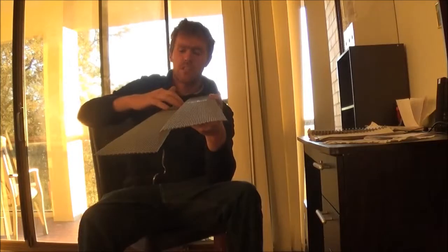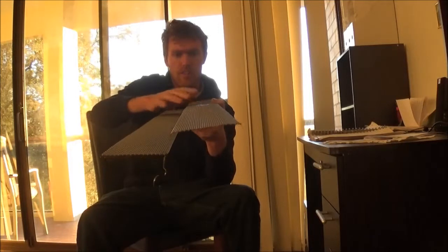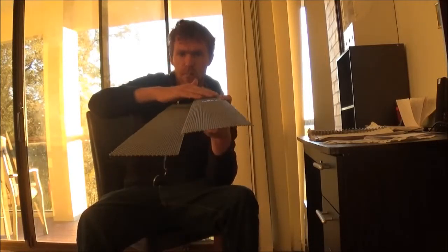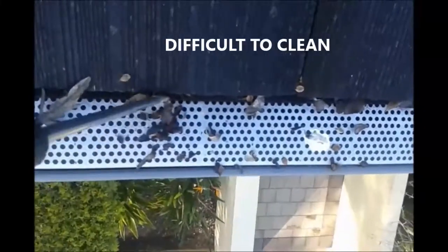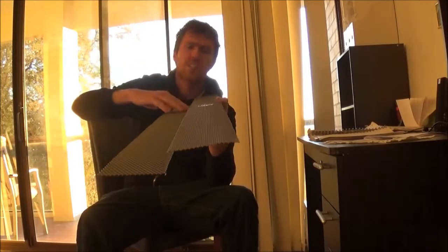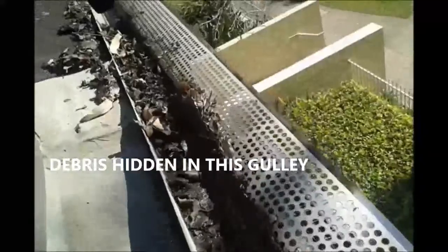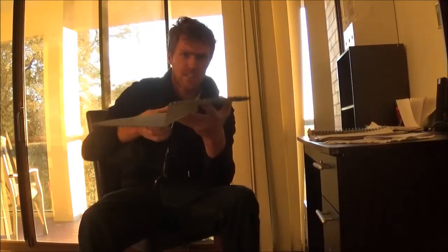This is really the detriment of this type of screen — not the end of the world if you've got it installed or want to do it yourself. By all means, do it. This is a pretty good guard. But what happens is the rubbish lands on top and gets pushed into this gully, collects there, and forms soil over time. That soil gets into the guttering and then you can get moss growing underneath.